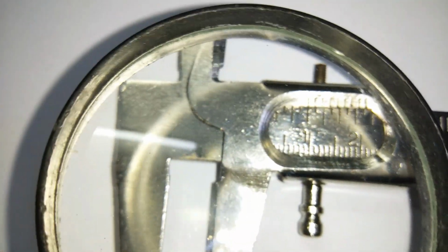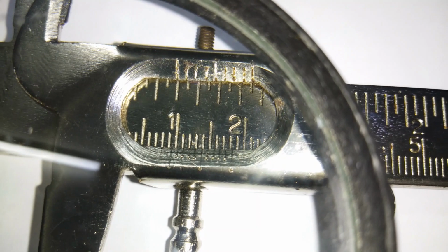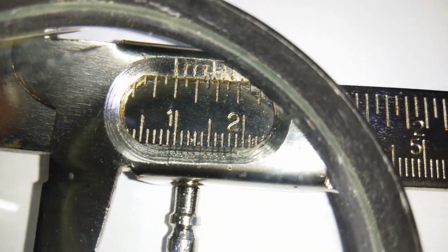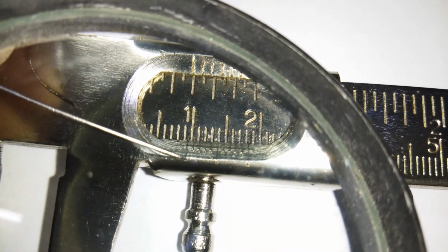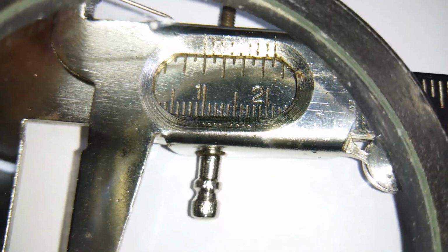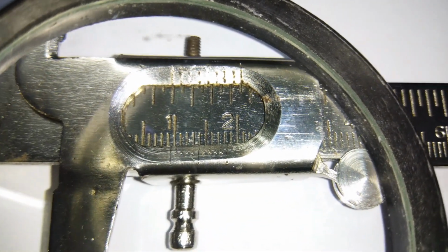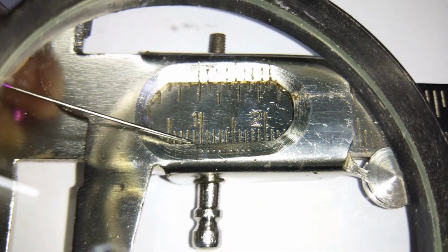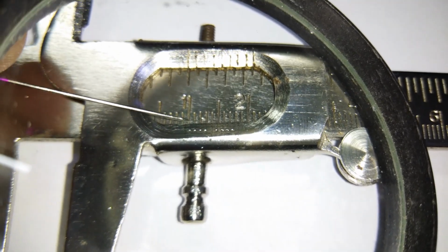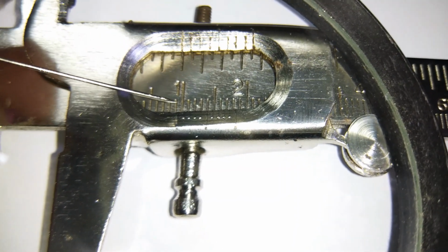For example, if I take this camera very close to here, you can see that here is the first vernier scale line. Look at this here, this is the first vernier scale line. This is before 1, it is not at 1 but just before 1. I'll make it quite clear here. Now you can see that the down line looks a little black here. This is before 1, between the 9 and the 10. This is 9 millimeter, and this is 10 millimeter, so it's in between. So I will not take the 10, I will take the one before that, this 9 millimeter.